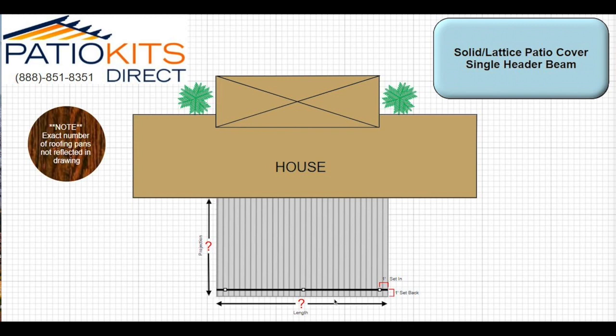The length is left to right — how much of the house do you want to cover? If you notice the post placement where the beam is, there is a one-foot setback, maybe 18 inches — this has a variable. The same rule applies to posts from left to right on the length — one foot inset, maybe 18 inches or two feet. From post to post on the left or right-hand side, depending on the size of the patio cover, we will tell you how many posts you will have. A single beam generally has more posts than a double beam, as a double beam provides more support.